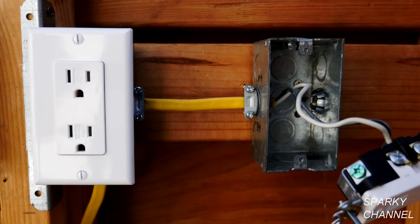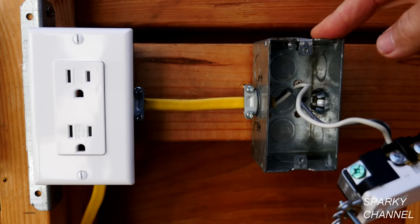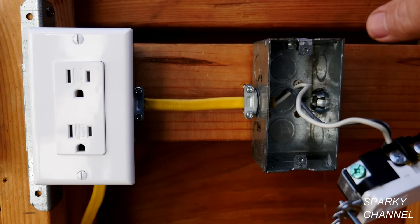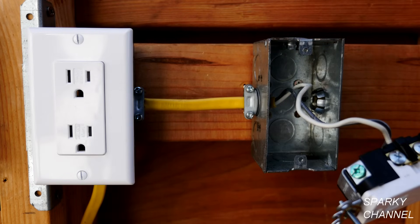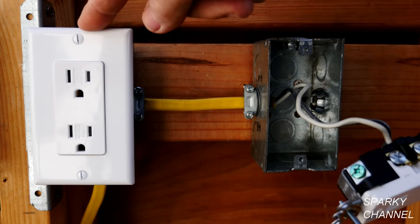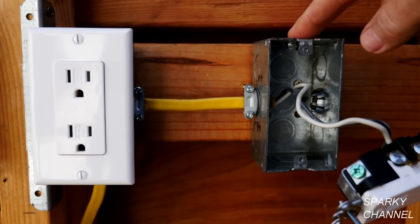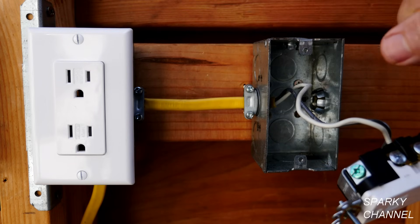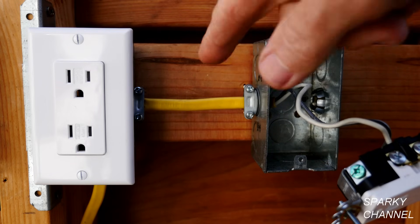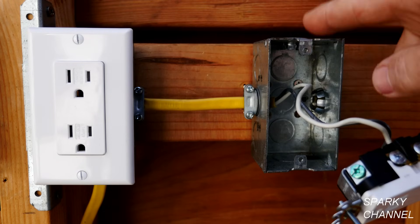It may be possible to remove the cable going from this receptacle to that receptacle and bring a ground wire to this one. But to do that, we're going to have to check for continuity. That will tell us if this receptacle is the next upstream receptacle — that is, one receptacle closer to the main panel. If so, we can change out the cable going from this box to that box and bring a ground to this box.